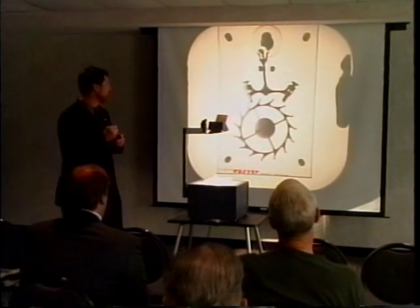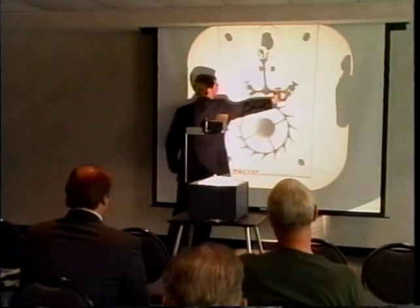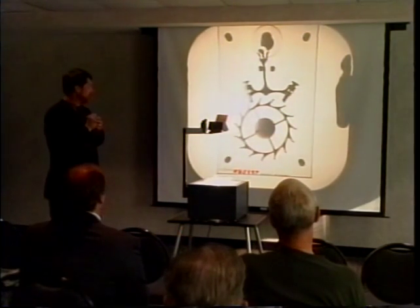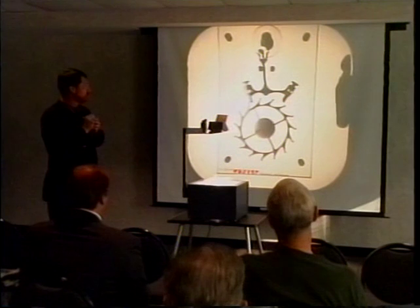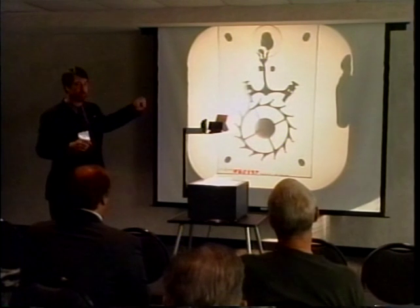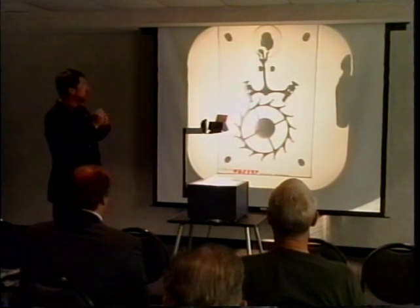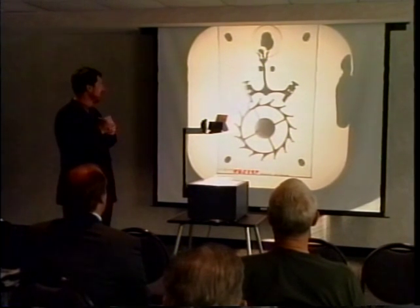So you had two arcs right here like this and like that. What happens is that because this corner was further away from the pallet center than this corner was, you had a stronger impulse here than here because of the lever arm action. So you'd get a real strong impulse from here, and on this side a weaker impulse, so you didn't have equal amplitudes. And then you had unlocking problems where, since you had a stronger lever arm from here to here, the unlocking was harder on this side than on this side.